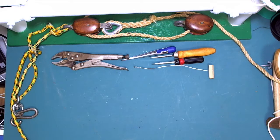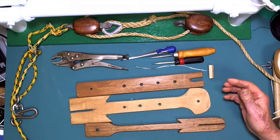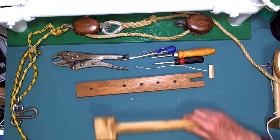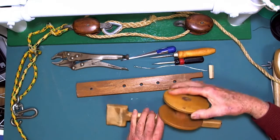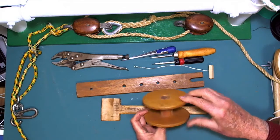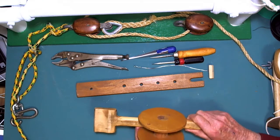With tensioning taken care of, the next thing, of course, is to use a serving board. Now, you've seen some of these, ones that looked a little bit like this one, and there are a lot of jobs, some of the jobs are unusual, so you might even have to make up something to suit a particular job. Even one like so is handy. This has got a hole in it, so you can put a reel on the side of it. Particularly useful if you're going to have a fairly long job and you don't want to be continually stopping to renew your line and pass balls around the stay, as you'll see when we do the job.